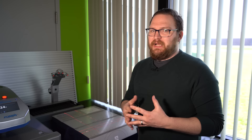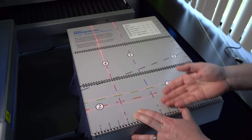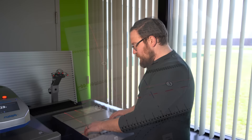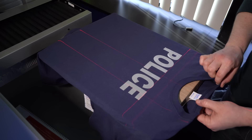Now over at our Dual Fusion IQ, let's talk laser alignment. We have the Hotronix Laser Alignment Wizard on the press. This helps you line up center or top front, top back, left chest, and a 15-degree angle print for script and tail designs. It lays easily on a full 16 by 20 platen, aligns your lasers, and shows you where your collar and tag should sit. It does take a little time to set up, but once set up you can get rolling.